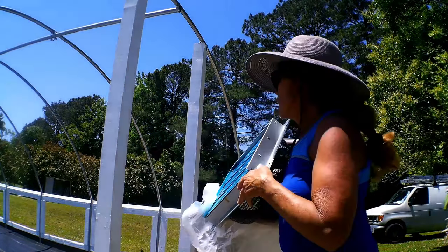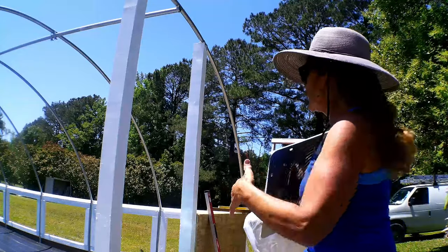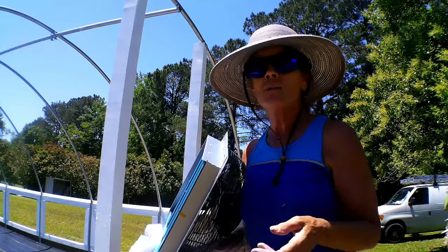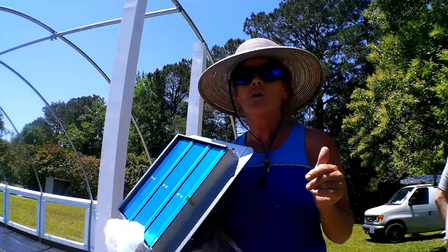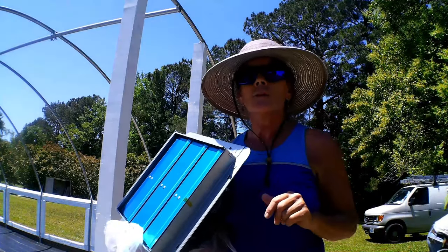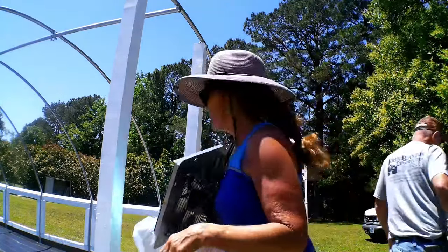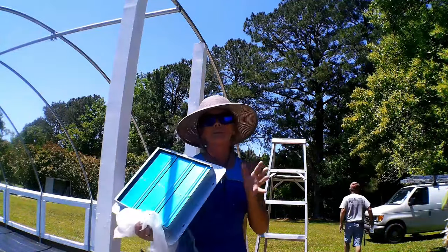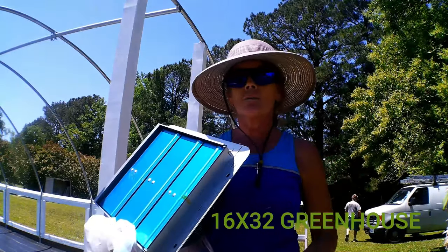And so we can see this end wall here is already done. Very simple technique. Piece of plywood, a couple 2x4s. I put some carriage bolts on the other side, screwing into the 2x4 from the pole on the outside end to secure that. But as far as the end walls, it's really simple. Just 4 2x4s. Cut your piece of plywood, you screw it in, done.